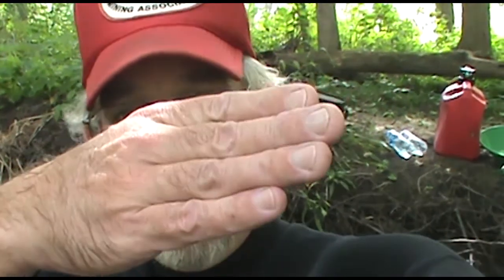I really should relabel it. I might have just labeled this video The Mistakes of a Newbie Dredger. Because my plug literally was right at the start of the jet, and it was one flat rock. Thing to watch out for if the visibility is working with you and you're not hogging too hard. Apparently I hogged it too hard because I sucked up a flat guy, and he turned in, and that was all it took. You couldn't bust him out no matter what kind of plunger stick you had. He wasn't leaving.